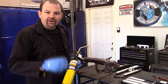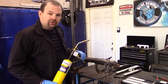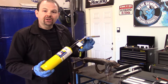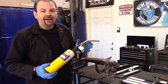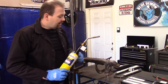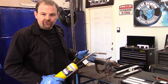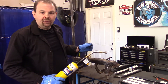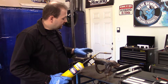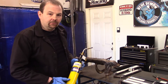We are finished padding beads and ready to get to work on our exhaust manifold. I have holes drilled and a groove made in our crack area. Now I'm going to bring this exhaust manifold up to around five to six hundred degrees — don't have to be super precise. I'm going to hopefully do this in one pass. If I get any porosity or underfill, I will go back, regrind, and go again with another rod. But hopefully we'll get it up to temperature, make one smooth pass, and be done with this repair.